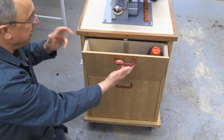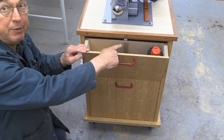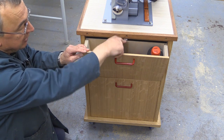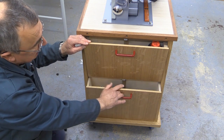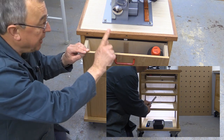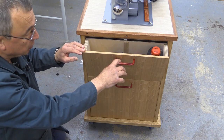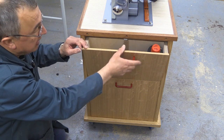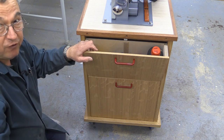The top one is very slightly different — a slightly different material, a question of what I had available. There's a little piece of aluminium angle fixed to the frame at the top, and a similar piece as well. On the back of each bin in the centre is a tiny peg of brass, which strikes that angle and stops the bin from opening all the way. If you want to take a bin out, you move that brass peg out of the way, which allows it to open beyond that point, then you just lift it off the springs.